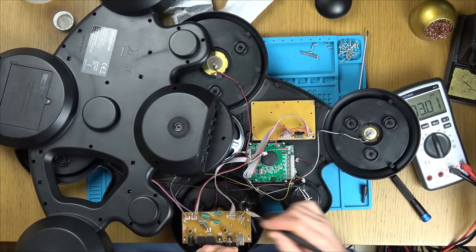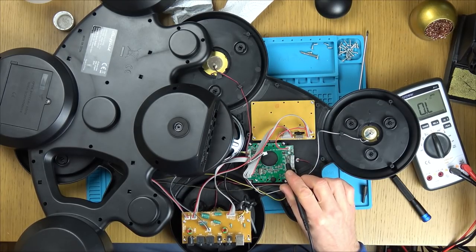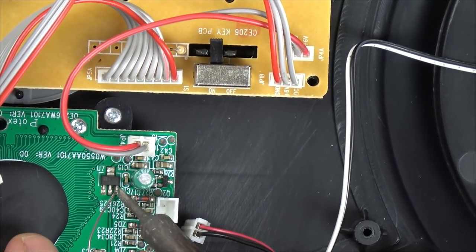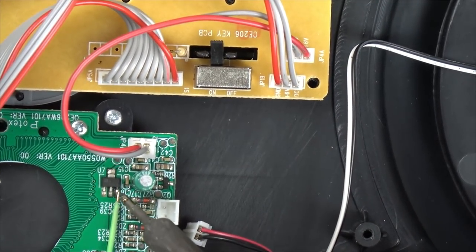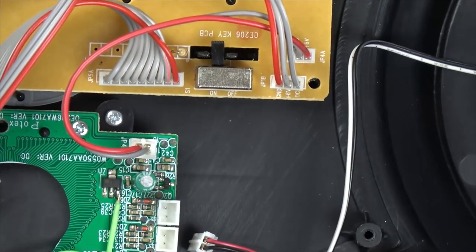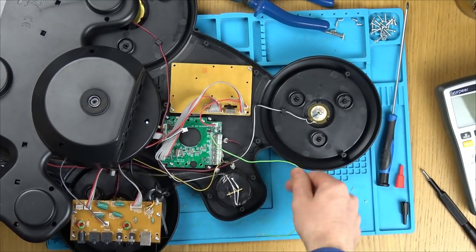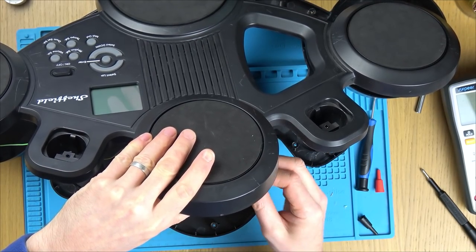Yeah, okay, so all the negatives are connected through. So I'm just going to clamp my bench power supply onto here and then a wire out from this voltage out pin on the right hand side. Just going to kill power to it. Okay, so now I can turn it the right way around and I can just have this wire sticking out the side. And you can see we're now going to push the 4 volts into the circuit. Right, I'm connecting the batteries back up.